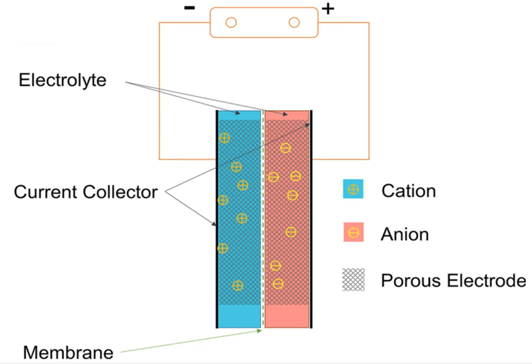L_x equals L_0 times 2 to the power of (T_0 minus T_x) over 10, with L_x equals estimated lifetime, L_0 equals specified lifetime, T_0 equals upper specified capacitor temperature, T_x equals actual operating temperature of the capacitor cell. Calculated with this formula, capacitors specified with 5000 h at 65 degrees Celsius have an estimated lifetime of 20,000 h at 45 degrees Celsius.